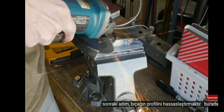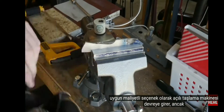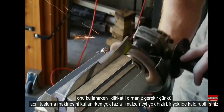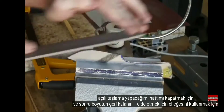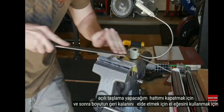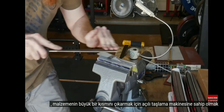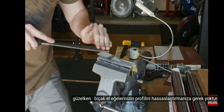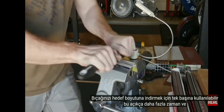Once we have the rough shape cut out, the next step is refining the profile of the knife. The angle grinder is the cost-efficient option here, however you need to be careful because you can take off too much material too fast. When using the angle grinder, I will grind down close to my line and then use the hand file to get the rest of the dimension. While the angle grinder is nice to have, it is not necessary — hand files can be employed alone to get your knife down to its target dimension.